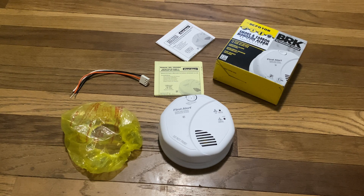If it chirps three times — as shown here — four beeps is a CO alarm, one chirp per minute means replace battery, three chirps per minute means malfunction, and five chirps per minute is end of life — both indicate replace alarm. The end of life and the malfunction chirp is mainly for the CO sensor, as far as I know. Regular smoke alarms don't normally have that; it's mainly for the CO sensor for the malfunction and end-of-life signal.